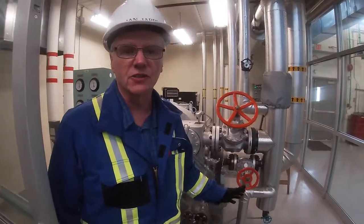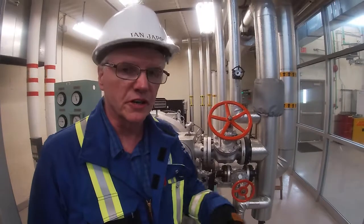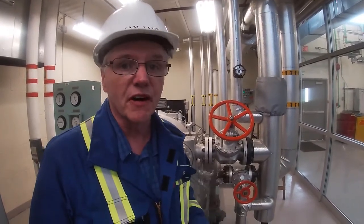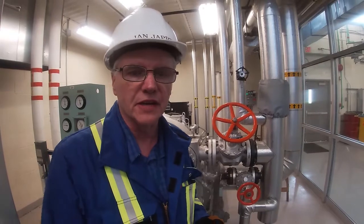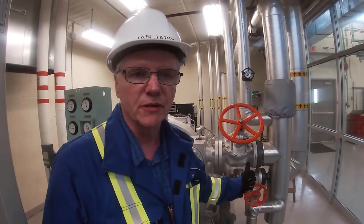We've been running at 1,000 RPM for 5 minutes on our ramp and soak schedule. Now we're going to use the governor to control the speed at a higher speed. We have another 5 minutes to ramp and soak at 1530 RPM. So we're going to go from the control panel and give it a signal to send the governor to control at 1530.